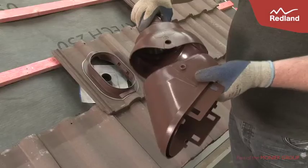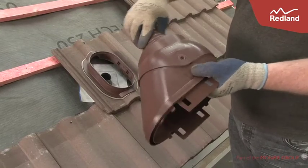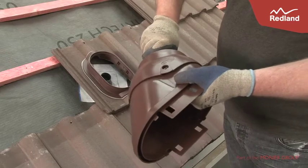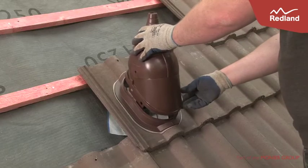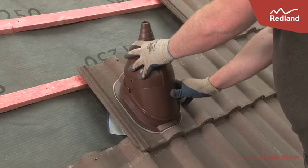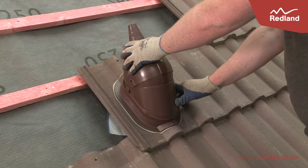Antenna adapter. The antenna adapter for fixing aerials or satellite dishes comes in two parts. Attach the top part one way round for a lower roof pitch range, or the other way round for a higher roof pitch range — this allows you to adjust the adapter to the correct roof pitch. Snap the antenna adapter onto the base tile with the outlet vertical. The base tile should be located so that the fixing pole can be mounted to a secure point in the roof.